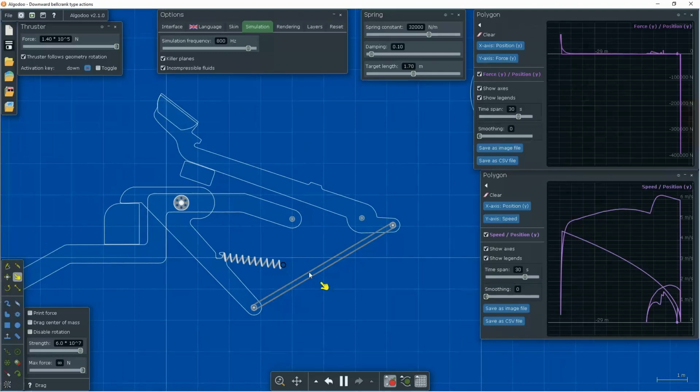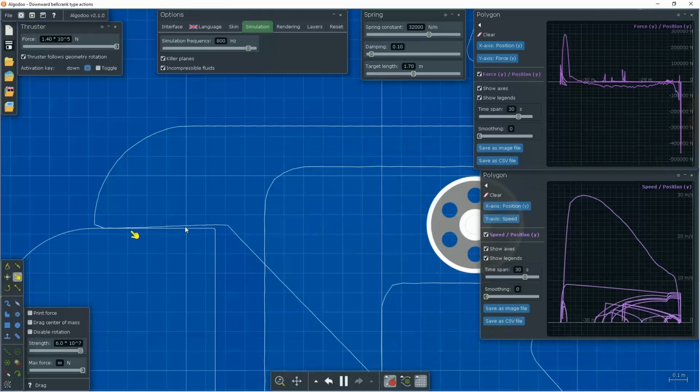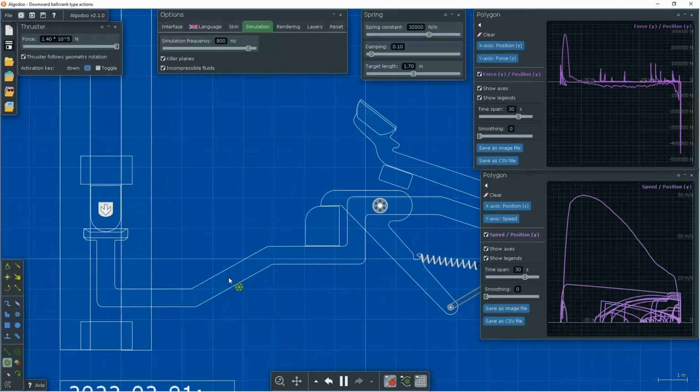You might notice that during the press, this piece here is held against this upper surface of that bar, but as you can see, we can lift this just fine, and indeed this is also possible on the actual machine itself. So that basically means that if you constrain the key lever to not move, your type bar is still capable of moving.